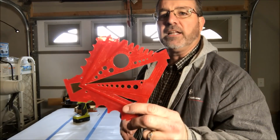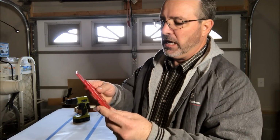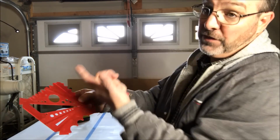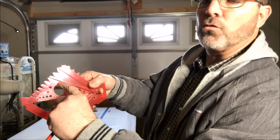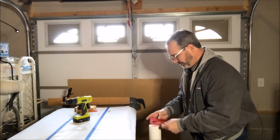This is a centering jig that I use. It's from Nova. I'm not being sponsored by them. It's just one that I found and I use. It's kind of nice. It's got a little lip on the bottom, and you lay the circle, or in this case circle, it could be any shape, into this little groove. And on the top, you draw a line, and you rotate it 4 or 5 times, and you'll find the center. Let me show you.